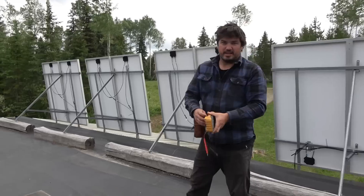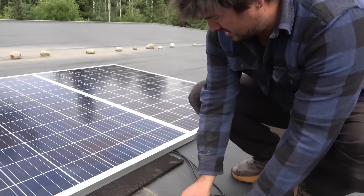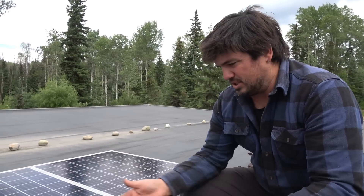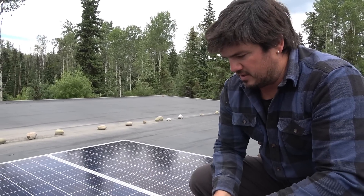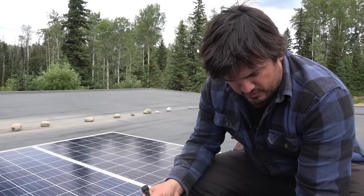Photovoltaics are kind of polite. If you want to receive power from them they'll give it to you, but if you say no thanks, they're like okay, I'll just wait here. They do get their voltage up a little bit, but other than that they're fine not sending the power. It's not particularly sunny right now, but solar panels will still put out power — there should be an amp or more — but clearly there's no current coming out. They can produce the power but they don't need to. This isn't a dangerous situation, though don't take any of this as safety advice.